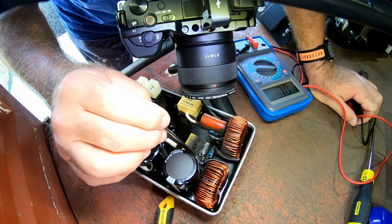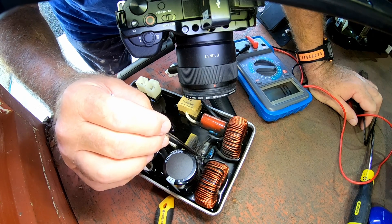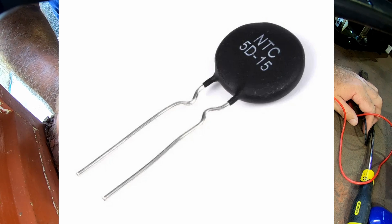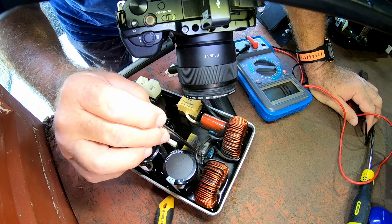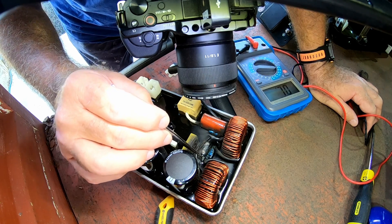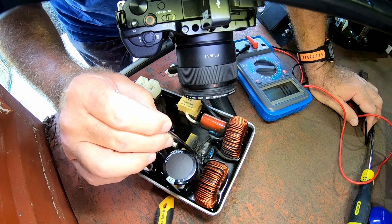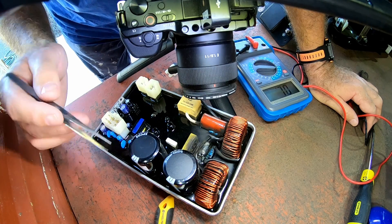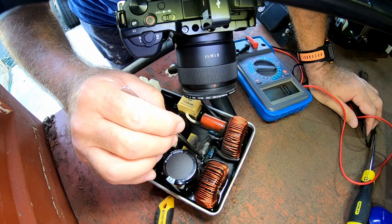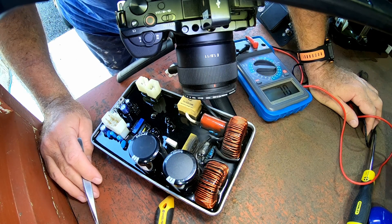I can also notice there are two little wires sticking out of the circuit board, and I think what this was is a thermistor or thermal resistor. These things are a circular piece of epoxy with carbon black in there that acts a bit like a fuse - if it gets too hot the epoxy melts, the carbon burns, and it opens the circuit. So all I'm left with now is two wires sticking up. Just for the sake of the exercise, I'm thinking of soldering those two points back together, putting the machine back together, and testing whether this inverter board might work again.